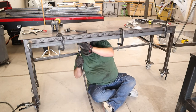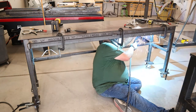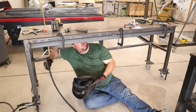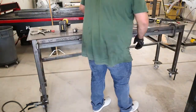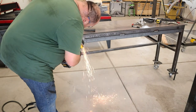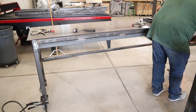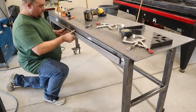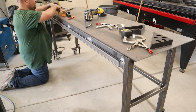It's kind of important to note that we had to build two of these benches. The finished product will be two of these benches, and in between them will sit two metal cutting saws — one is an Evolution saw that looks more like a traditional compound miter saw, and then the other one's that dry-cut DeWalt saw that you saw earlier in the video. I really like the Evolution saw for its ability to do quick miters on tube, and then the DeWalt saw is just great for cutting heavier material. And if it gets any heavier than that I do have a Jet band saw — a 10-inch Jet fluid-cutting saw — so we use it for cutting all the really heavy material.